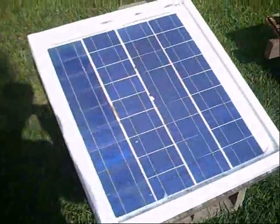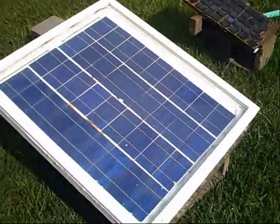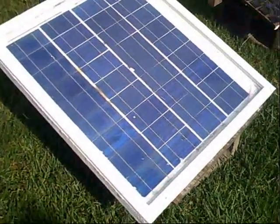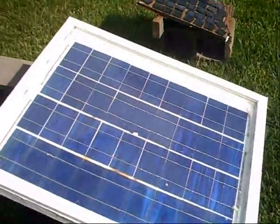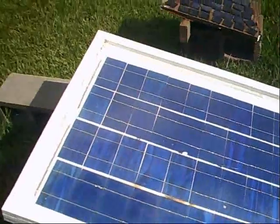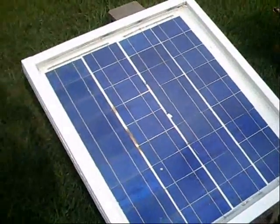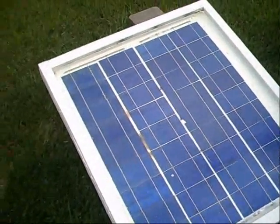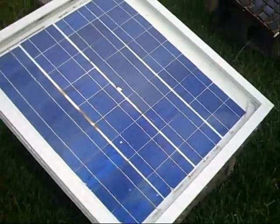This one here was my very first decent solar panel. I've seen all kinds of videos on YouTube about how to tin tabbing wire and this and that. But what I didn't know when I was building this one was that the tabbing wire that I got with the kit was already tinned. So I ended up adding a whole bunch of solder to it — three or four tubes before I finished the panel — and that affected overall output. On a good day when the cells are nice and cool, I can get about two amps out of it, but on average it produces about 1.2, give or take.